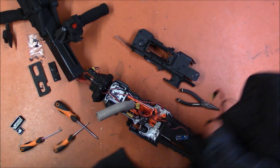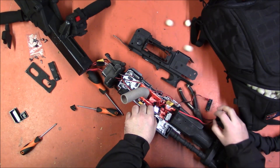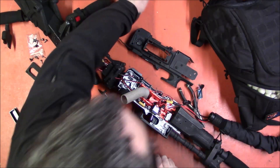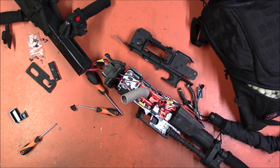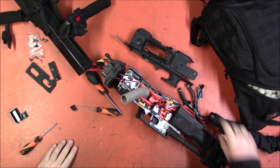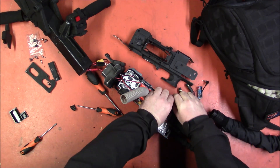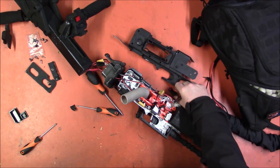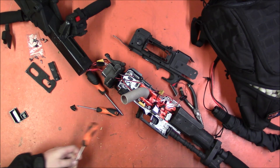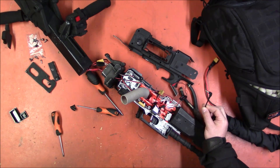Behold, a newer style proton pack. Science. Just the motor controllers and the Arduino are pulling enough current to almost activate the tank, but not quite, which is very bad for the tank. So this blaster may have to use a non-current-sensing system. Or we use this other option — we'll see.